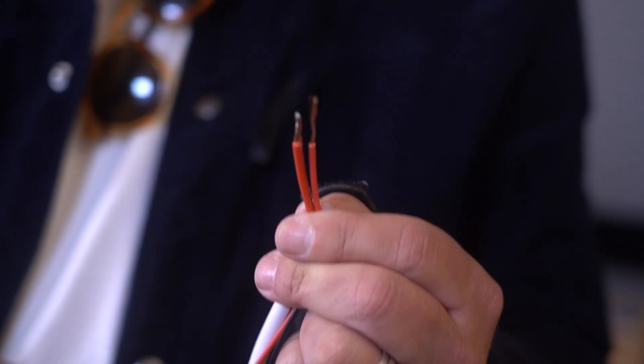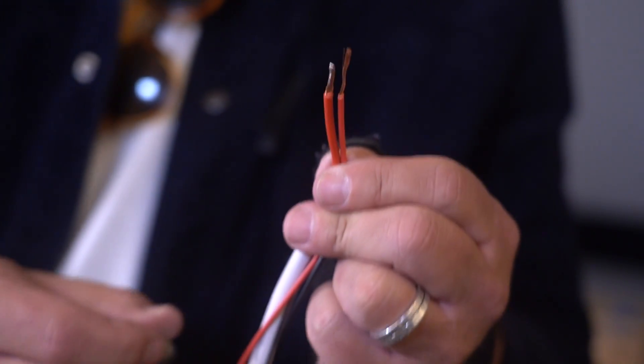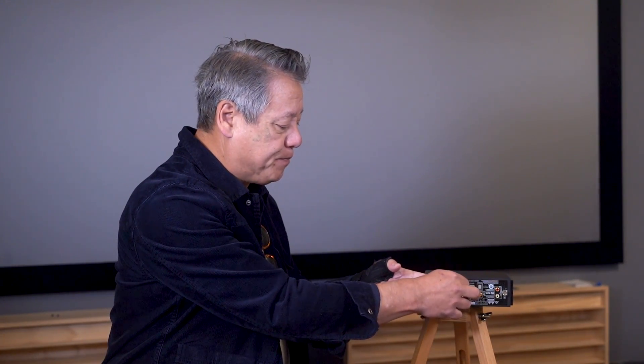The reason I say that is if you're not careful — especially at the beginning when you're not comfortable with all the nuances of connection — there's actually a hole drilled through the screw mechanism here, oriented to point right at the other connector. If you have a wire that's a little too long or just a few strands sticking out, you can do what's called a dead short. That's called that because hot and ground will touch together, and when you do that you can damage your amplifier.